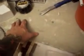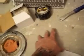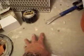Now when you do this, you want to stick your screws about every 6 to 8 inches. John himself tacked this in. He likes to use 8 inches. Me, I prefer 6 inches. That way when you walk on it, there's no squeaking, there's no give.